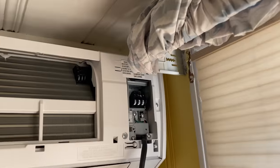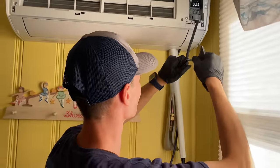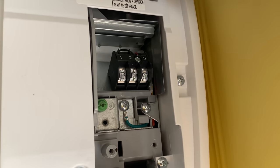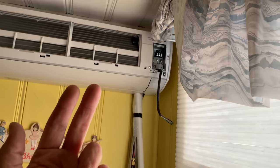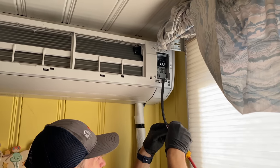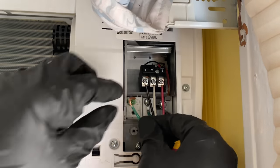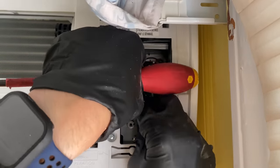Check out Daniel's YouTube channel — it's DC HVAC. We're going to do the wiring. There are three terminals marked one, two, and three, plus a ground connection. What works for me is black on one, white on two, red on three. On the low-wall Fujitsu units terminals one, two, and three are actually marked black, white, red. The ground goes to that little screw terminal. When looping the ground wire, orient it clockwise — if it's counterclockwise it'll want to come out when you tighten it.